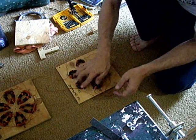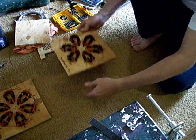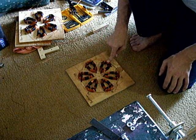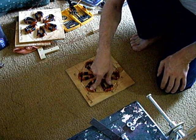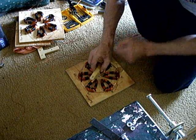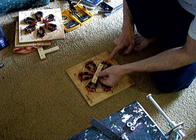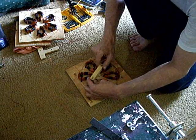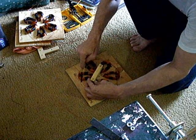This is going to be our bottom side of the top plate. Just so everybody understands what's going on here, I'm going to set this one aside for a moment. Pulling my bottom plate - we've got coil 1A and coil 1B. Now we know that all of our coil 1s must fire north at the same time. If we pretend this is our magnet in this position, north is facing that way, and also north on this end for my second north coil. That means on top here we've got a south and a south, so in my four-magnet configuration they're going to be 90 degrees off for my other north - the other north will be here and here.